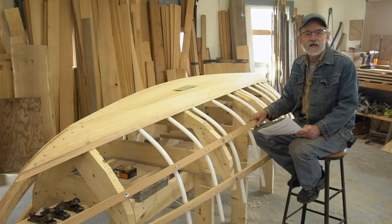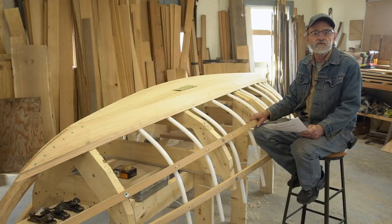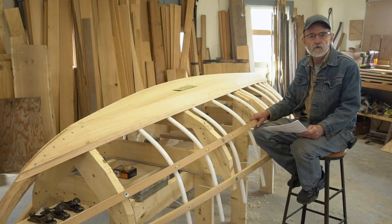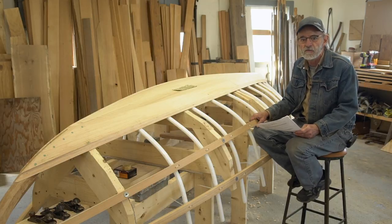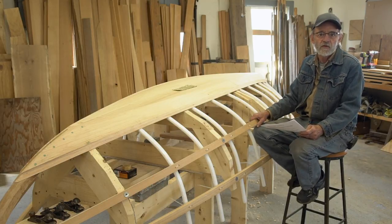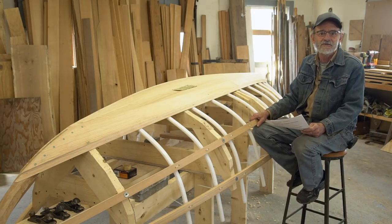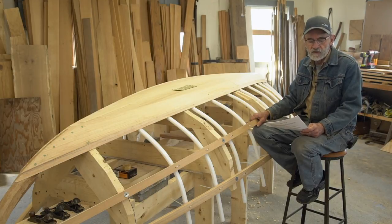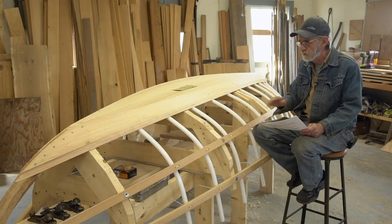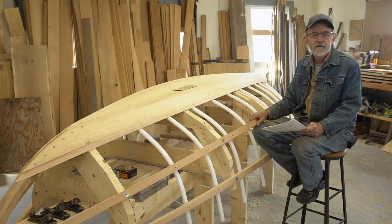Well, there was a time when there wasn't any epoxy glue, so they would always use shellac. Shellac seals up the hole really nicely. It seals up the plug really well. It stops water from getting in, and it does kind of act like a glue, but if you wanted to pluck that plug out, it would be a little bit easier to get it out than if you epoxied the plugs in. So that's why we do it. It's been going on for years and years, using yellow shellac to put plugs in. It's an advantage not to put them in dry, and if you line the grain up and use shellac, it'll work out for you perfectly. You don't have to mix it, and all those different things.